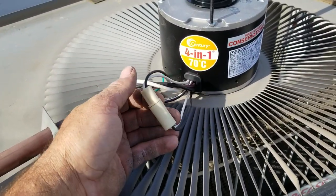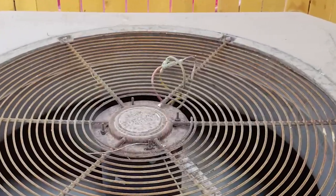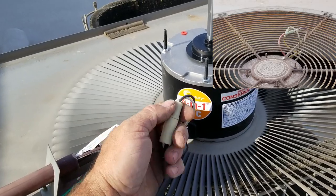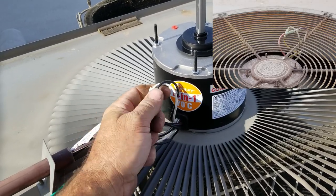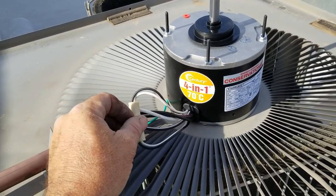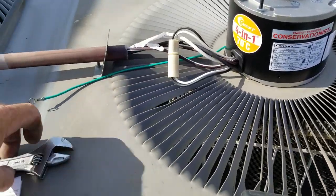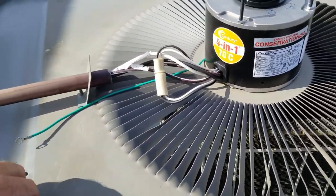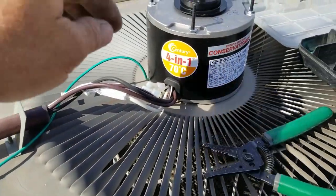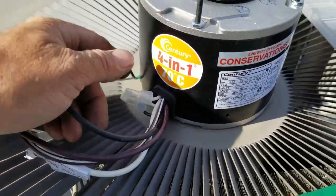Here's the reversing wires. People are notorious for jamming these up through the fins and connecting them on the other side to hold them up and out of the fan, which keeps them up but now you've got wires where the sun's going to rot them, they'll get bare, and people are going to get shocked. What I do is figure out which direction it needs to go, and these are crimped nice and short to the motor. They're not going anywhere.